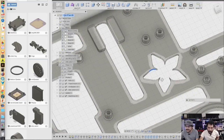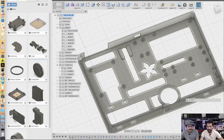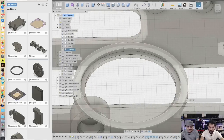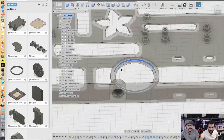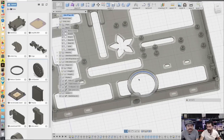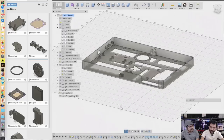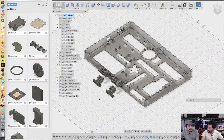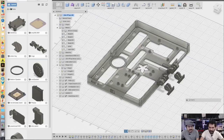Yeah. Of course, if you want to change your logo around too, you just go in there and delete the faces for that, and it'll close up that hole there. Cool. And some of the other things you might want to change are some of the tolerances for like the speaker that's on there. It can change depending on what printer you're using. Yeah, sometimes suppliers change their tolerances and things. We're using the Type A machines, or you can use something like a Lulzbot, Taz.